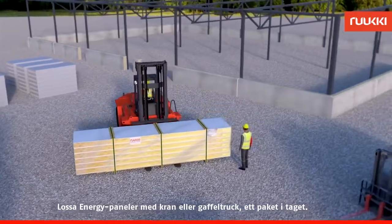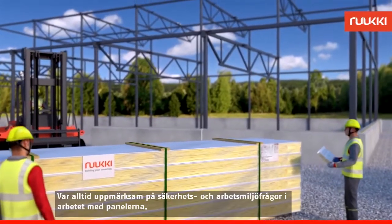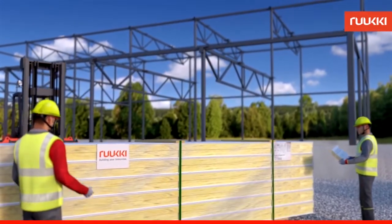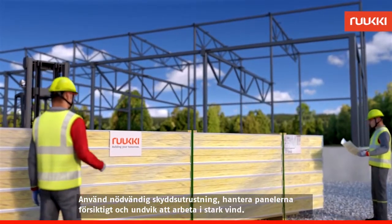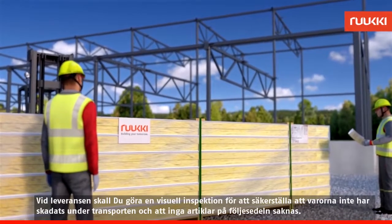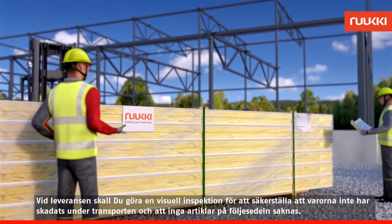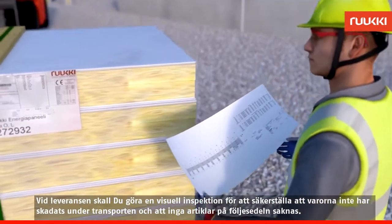Unload energy panels using a crane or forklift, one package at a time. Always pay attention to health and safety aspects when working with the panels. Use the necessary protective equipment. Handle the panels with care and avoid working in strong winds. Upon delivery, make a visual inspection to ensure that the goods have not been damaged during transportation and that no items listed on the delivery note are missing.